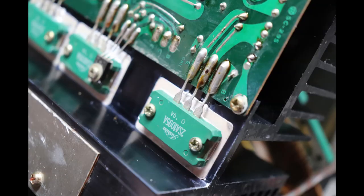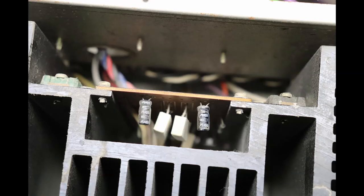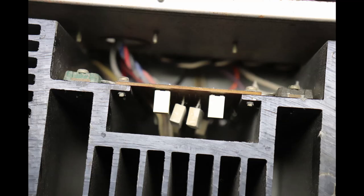There are two electrolytic capacitors on the output transistor assembly and I'm going to replace those. What I ended up replacing them with were Kemet film capacitors — sometimes for small electrolytic capacitors in the signal path I'll replace them with film capacitors, and I did in this case.